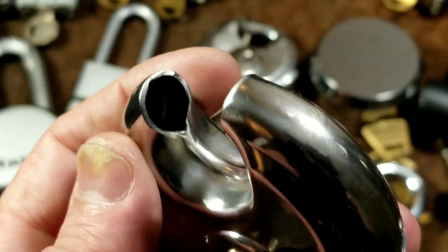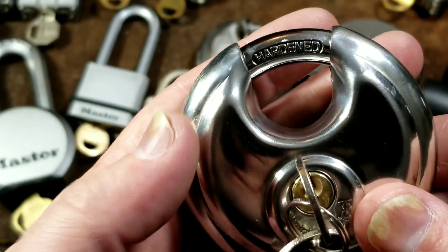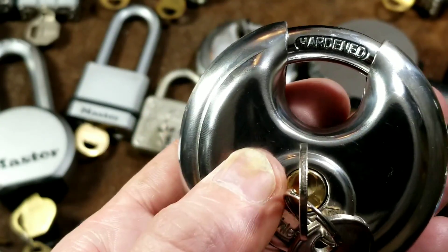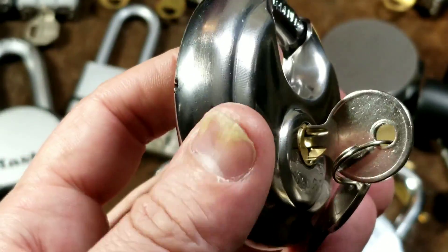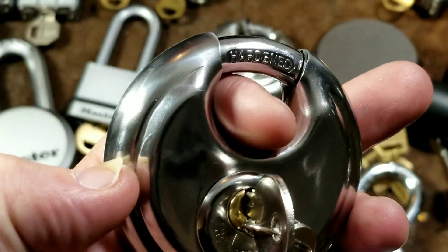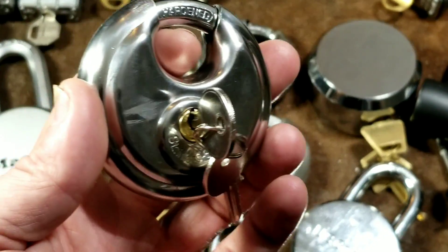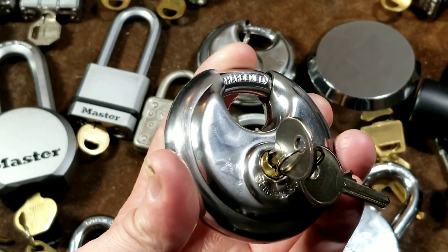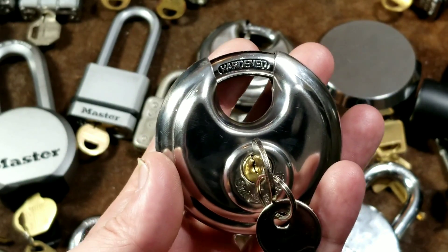Regardless of how twist-resistant a disc padlock is - and that's the main selling point - the shackle goes three quarters of the way around. When you open it up, we can see inside with a flashlight there's the other end of the shackle, so the shackle goes most of the way around the lock and has very limited access space for bolt cutters. This is sheet metal stainless steel, and regardless of what grade - even fully through-hardened 440C stainless steel, what they make knife blades out of - you're still going to get through it with a hacksaw. That's why I've never liked disc padlocks: the sheet metal body. Since learning how lock cores and everything else can be drilled out so easily, you basically have to use the heaviest duty lock you can effectively afford and do research.